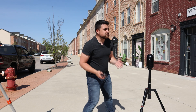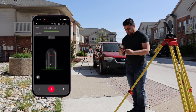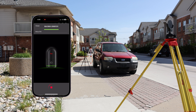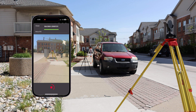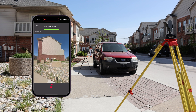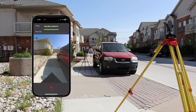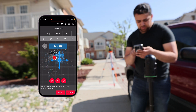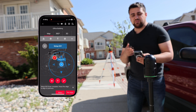Now that we're done with the first setup, let's move the BLK laser scanner and scan the side of the building. I'll select the new scan button, everything looks good, and we'll begin scanning. We can see our point number two target and the whole building is covered — every aspect of it. There is target number three as well. The second scan shows up right on top of the first scan. Once we're done with all three scans, I'll show you how to register all of them in the Field360 app. I'll quickly measure and annotate the height of this target — looks like 5.06 feet.